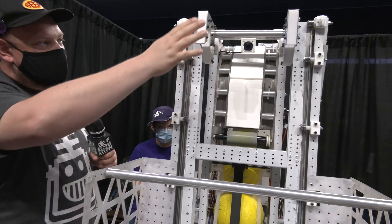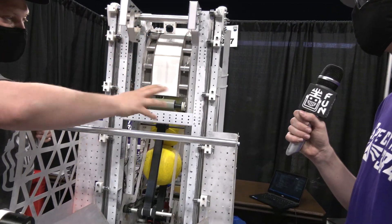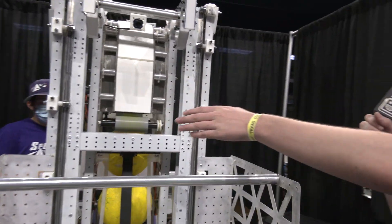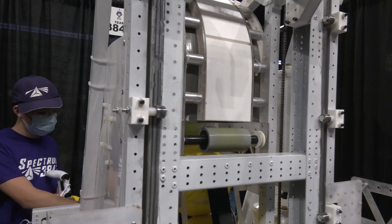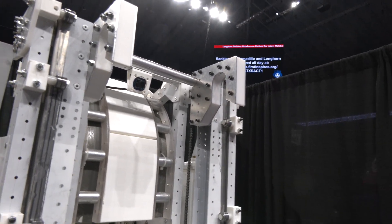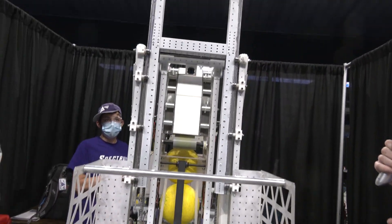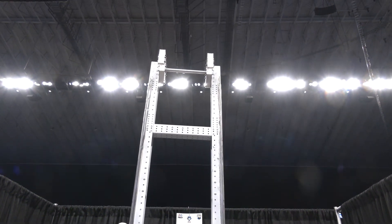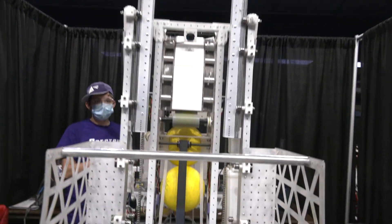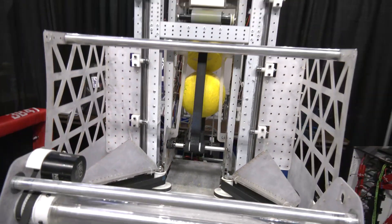Next up, the climber mechanism. It looks like a single stage — tell me about the concept design and what goes into it. For the climber we have an elevator with motors at the bottom pulling chains that raises the climber. We have fixed hooks so we cannot traverse the bar. But we've got a really sturdy build so the climber can handle holding on either side. Worst case scenario, one hook holds and it still manages to hang on. We wanted a sturdy build that could hold the weight of our robot, which right now is 121 pounds even.